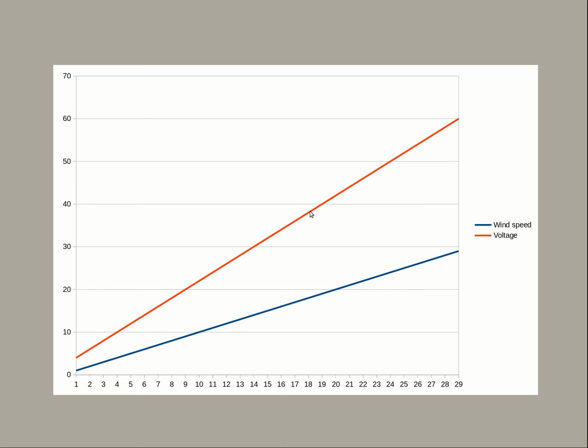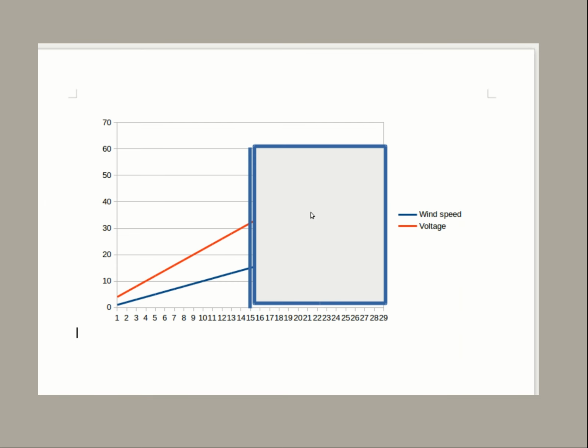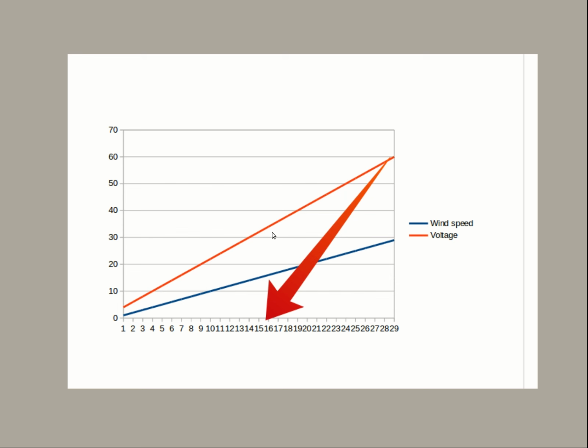We should be able to use that energy, and my wind turbine is only making 35 watts, so I decided that rather than just dump everything above 15 volts, we would take everything above 15 volts and regulate it back down to 15 volts. Seems a lot more efficient to me, and this will work all the way out to 40 volts. 40 volts is the cutoff for the circuit we're going to build. Just dumping that always seems weird to me.